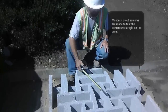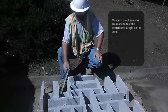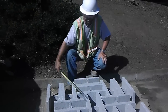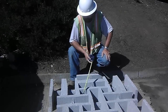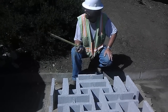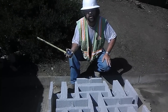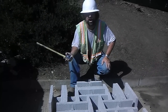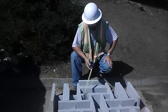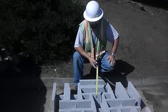Typically, I'll put a pair of 2x4s on top of these blocks and another scrap piece of wood over the top to protect the samples after I make it. The block will absorb the water through the paper, simulating the way the grout water is absorbed during grout placement by the CMU block. The paper keeps the grout from bonding to the block while allowing the moisture to go through.